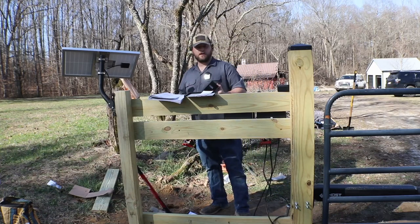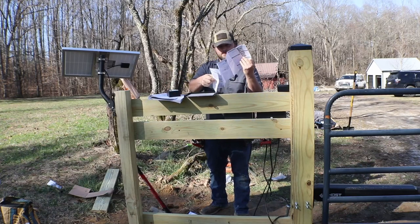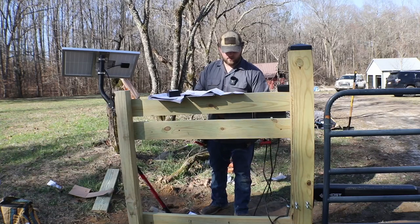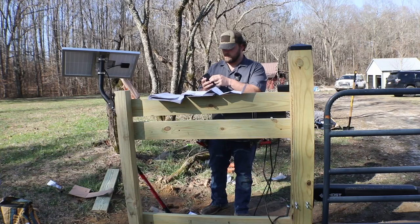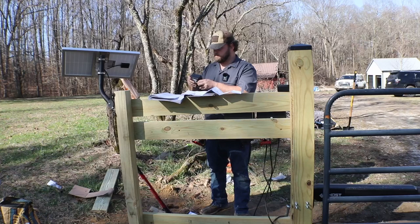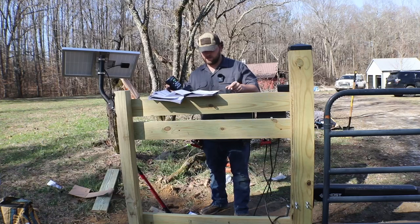So when you go to program the keypad, you've got to make sure that your wireless remotes are working. Once you verify that your wireless remotes are working, you can do the setup for the keypad. So make sure we follow the instructions. This is my first time, so if you guys could just bear with me. All right. Install the batteries, any C size battery. Recommendation is Energizer and Duracell per their manual. All right. You've got to have your transmitter with you for this portion.